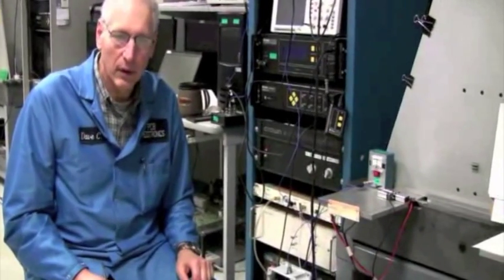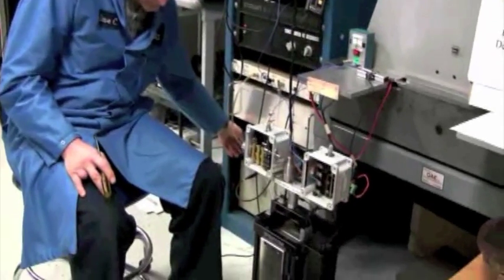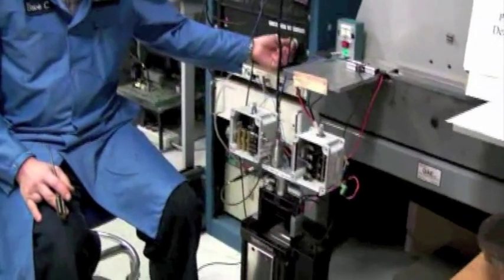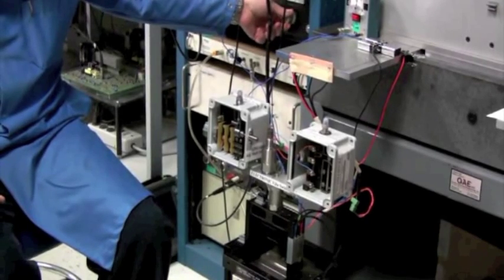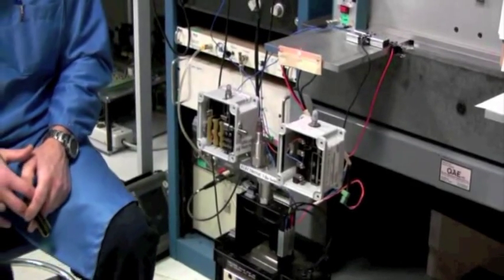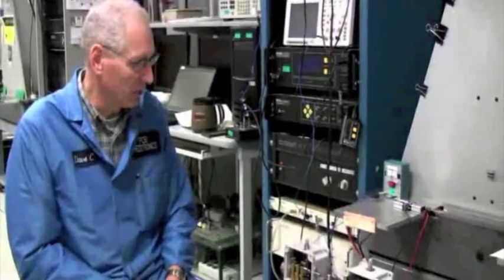We're going to run a similar test at 5 Hertz that will simulate a 300 RPM fan. So I'll get the shaker ready for use. And again, I'm going to gradually turn up the amplitude and see which switch trips first. And you can see right away it's the electronic switch that tripped immediately when it reached the 0.7 inches per second, which is about, I think, 30 or 40 mils of displacement.